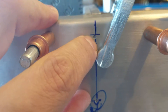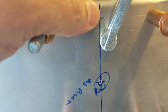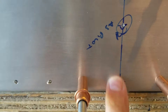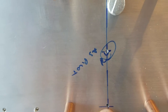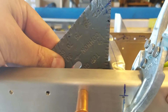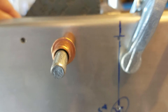Whereas if you use this side, it's pretty consistent all the way across, although you do get some little buckles here and there. The same goes on the ends when you're drawing those center lines to use through your pilot holes or sight holes. What I do is line up this sight line in relation to the line I've drawn on the spar - I've got to come to the right a little bit with this rib and try to maintain as much of a line as I can. I want the sight line inside the hole to line up with this line as much as possible. However, I want the rib to be perfectly vertical in relation to the spar, so I take the square and make sure that's the case, then do a final drill on the holes.